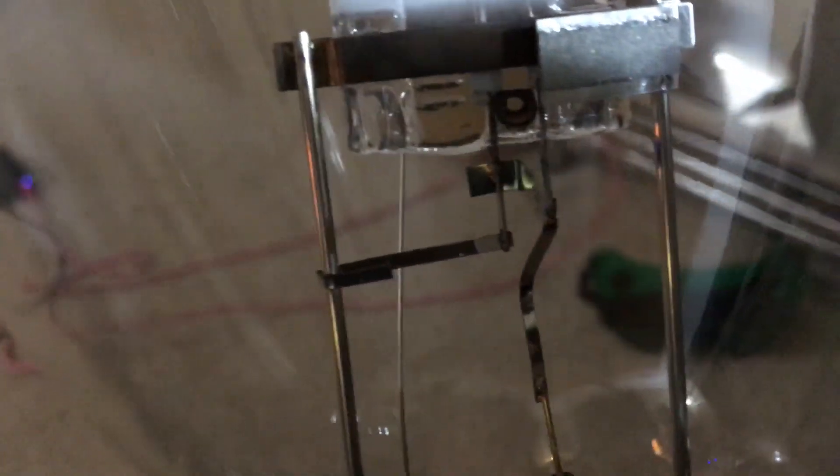Here's the probe start resistor as well. You can see the probe circuit right here — I'm not sure what that thing is on the far end of the arc tube on the bottom. And here's the arc tube itself. As you can see, it has different types of halide salts in the arc tube. This is what a 5000K metal halide arc tube looks like. Some of the halide salts give off a scarlet color when in a solid state — that's pretty cool. The 5000K color is created by different halide salts, and you can see some are scarlet red while most are orangey-yellow.